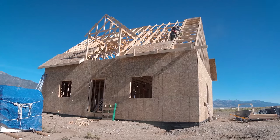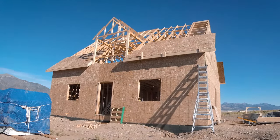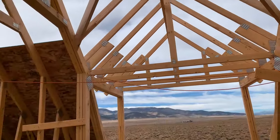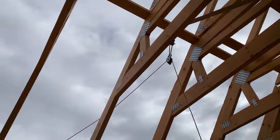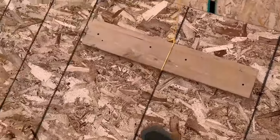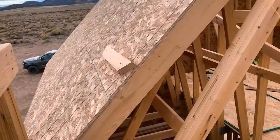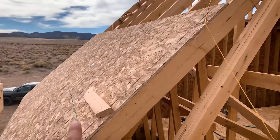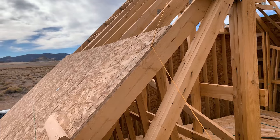I've now got three high on this side and still two high on the other side. Getting the third one up was doable, but it's only getting harder for the fourth and fifth ones. So I wanted a plan that took the stress off standing on the outside of the roof and pushing them up — and it's basically a pulley. That'll have to be moved by the time I get to the next run. It comes down here onto this guy with two-inch screws that don't go all the way through but go a half inch into a 5/8 piece, and then this block here. I'll just manually lift it up, set it on the block, come back inside, pull the cable, raise it up till it slots in, and then it's easy — I can just slide it left or right to go where it needs to go.